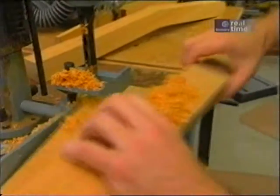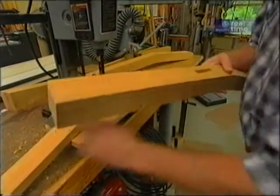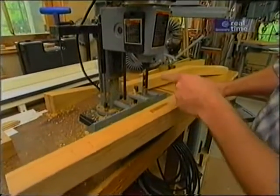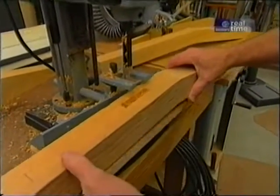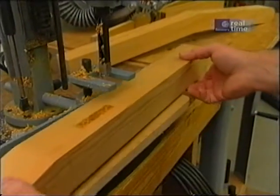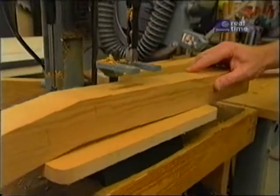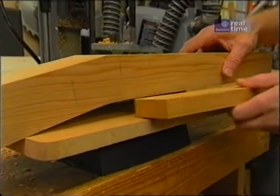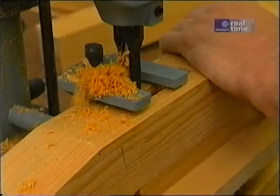The entire chair is held together by mortise and tenon joints, except for the seat slats. So here I've turned to my dedicated mortiser to make the mortises. I have a half-inch chisel set up, and what I'm trying to do is get a 7/8-inch-wide mortise — so I make one run from this side, then I turn it around and go from the other side. Because of the angle this piece sits on the table, it's not going to be flat when I'm cutting that mortise. So I've simply taken a scrap piece of stock, which I can slide underneath it, and move it along as I drill it out.